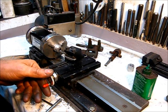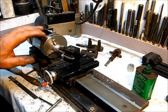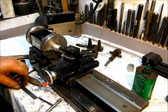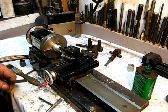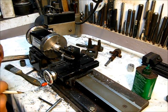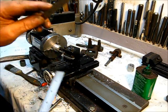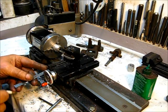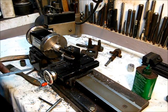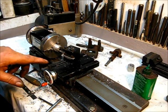The depth of cut is one half inch. I'll just bring that bit up there and rotate it to where it just kisses the edge. This is not a precision cut, even though I do want it to be good. This ruler happens to be one half inch wide, so I'm just going to lay it right in there, take the pencil, and make a mark on the lathe bed. That's a half inch mark.